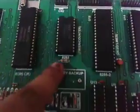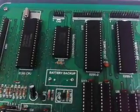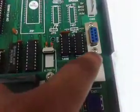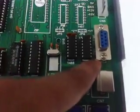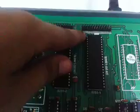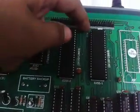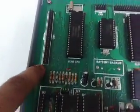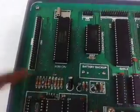3 numbers of 16-bit timer and counter are provided using 8253. An RS232 connector is provided for serial interface using SID and SOD lines. A 26-pin FRC connector is provided for connecting interfacing cards, and a 50-pin FRC connector is provided for connecting study cards with the 8085 microprocessor kit.